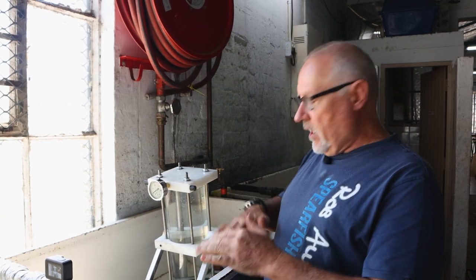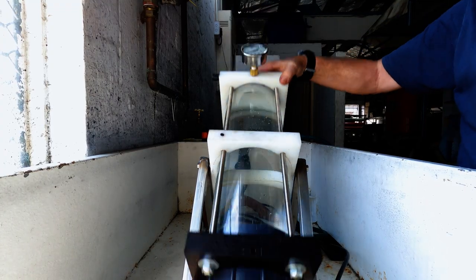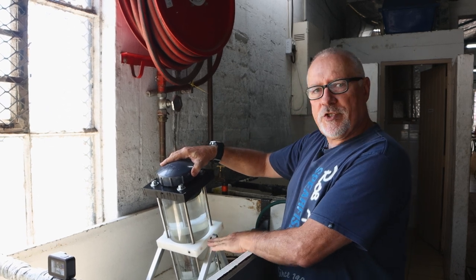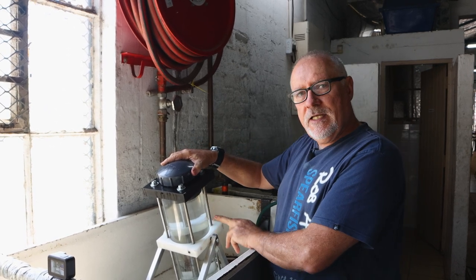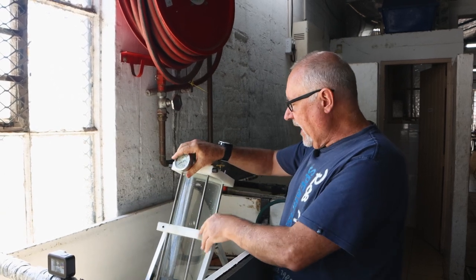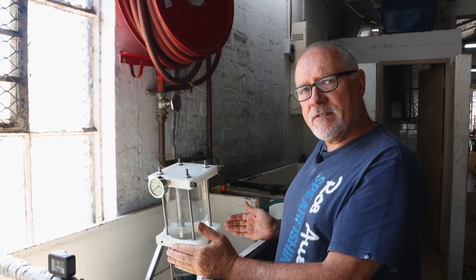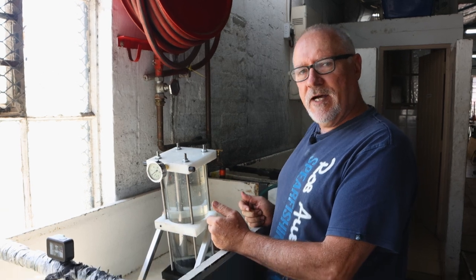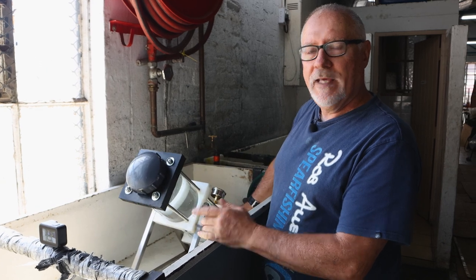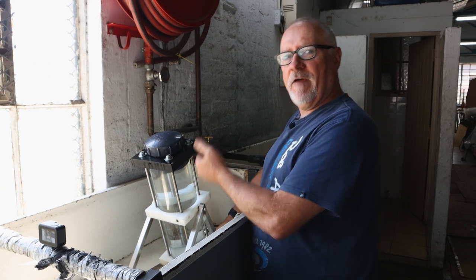What you do is you have a chamber half full of water and the rest is air. You put the device inside. Through a lid there is an attachment point inside. You pressurize that with air — if there's a leak in the device, the air will go into the device. You then quickly swing it around, flooding it and releasing the air at the same time, so the air will now escape out of the device and not enter it. If you see bubbles coming out, you know there's a leak. You quickly turn it back out of the water and it'll be dry.